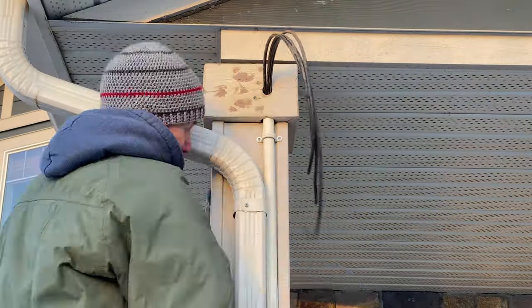Lastly we need to get the cameras plugged into the NVR and check out some daytime and nighttime 4K footage. Let's start here in the driveway where I'm holding a license plate. Here at 60 feet or 18 meters I'll stop the picture so we can zoom in digitally and check out that image — you can read it perfectly. Such a great 4K image. Outstanding resolution and awesome colours. This downspout however is a little close to the camera and might cause a little glow at night, so I may need to shift the camera to get this out of my shot. Reflections can cause glare, making the camera think it's a bright light and automatically adjust the image making the rest of the image darker — you're going to lose detail. So here's a shot with too much downspout causing too much reflection. I'm going to move the camera a little bit to the right to get rid of that.